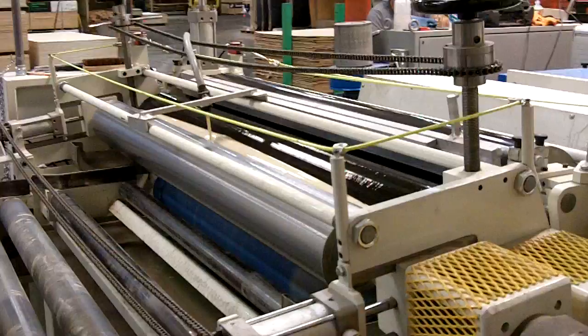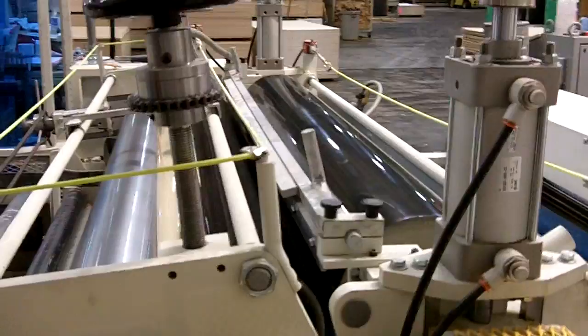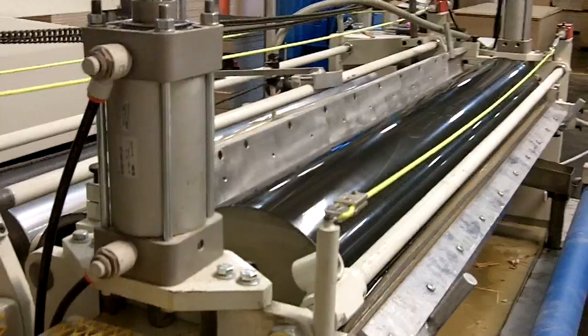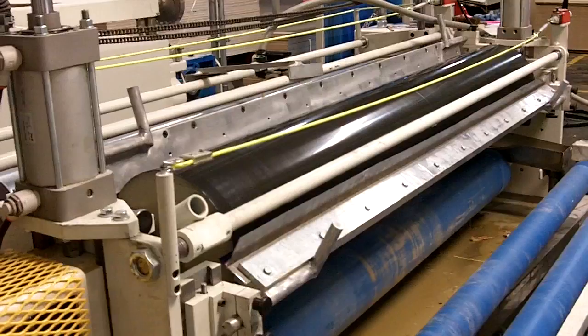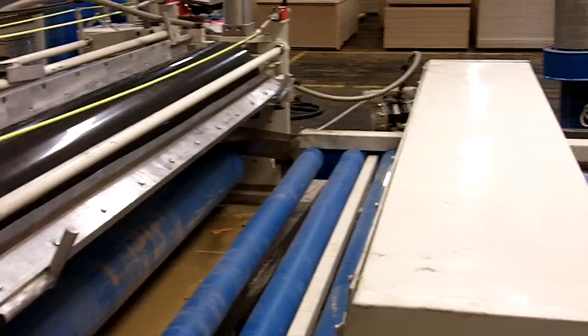This is our reverse roll coater, very similar to a normal reverse roll coater, but basically what it has is a ceramic roll on the back which squeegees off the excess finish, so you can lay down a very heavy finish and then squeegee that off to fill in all the open grain and any low-pressure points in the panel. They can then be sanded flat.